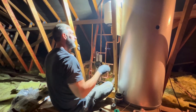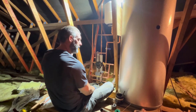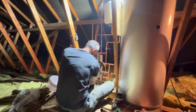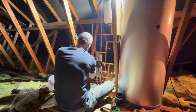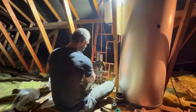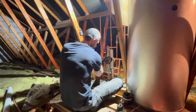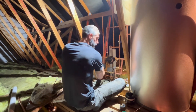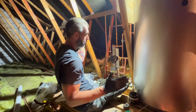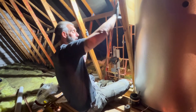We've also got a pressure vessel for the heating, which is going to be fitted there. This is the pipe straight off the boiler — your primary flow — which picks up the pump. What's important is I've got this little T-piece here. That's important because there's no interruption in this pipe straight to the boiler. We don't want any valves between this pipe and where our heating expansion vessel connects.